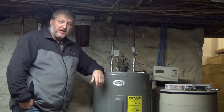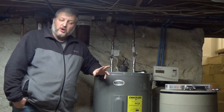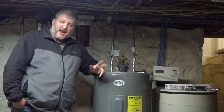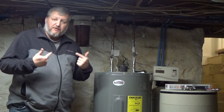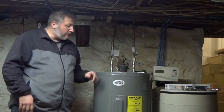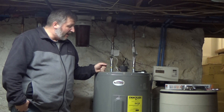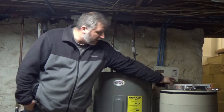The one that comes in this heater is magnesium. I've looked around and searched online — I looked at aluminum ones with zinc. If it's zinc, it's supposed to not give off the sulfur oxide. The minerals in the water react to it and give you that sulfur smell, or what some people call a rotten egg smell. I've got it pretty bad here in my house, so that's why I'm going to take the anode rod out and replace it.